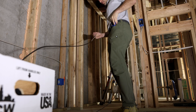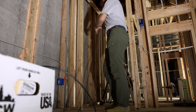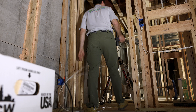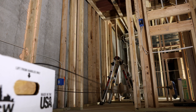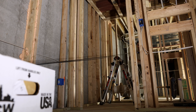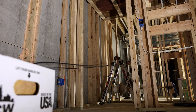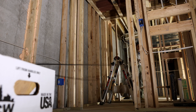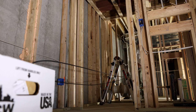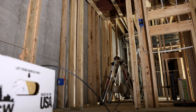So now I'm going to cut my first set of wires here. You also have to remember that you are going into a rack, so you do have to leave a little bit of extra cable that is going to get wasted. It'll come down the wall and come out, and I always leave a little umbilical and I trace it out like I'm actually going to do the rack, so I know that I'm probably going to need about this much cable coming out of the wall. Today I don't have a ton of speaker wire, so I don't want to waste too much of that.